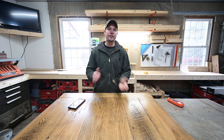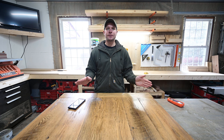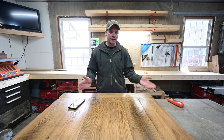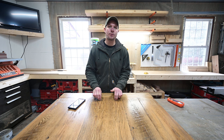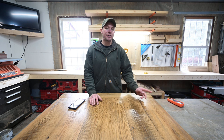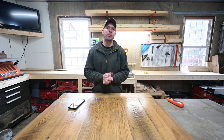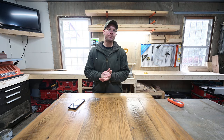There are some cases where air drying lumber is going to be just fine — like a laundry room, mudroom, bathroom, or outdoor furniture. But in this case it was in their dining room right where the heaters are during winter months, so it obviously was not a good fit. To play it safe moving forward, I'm only going to be using kiln dried lumber. I actually bought a sawmill, so I'll let my lumber air dry down below 20% and then I'm going to build a kiln in my basement to get it down to the proper moisture content.